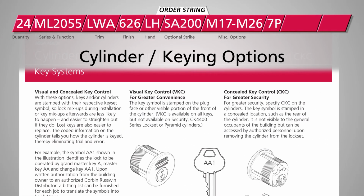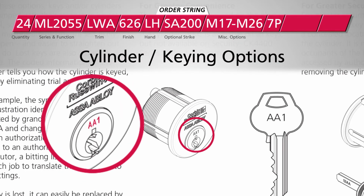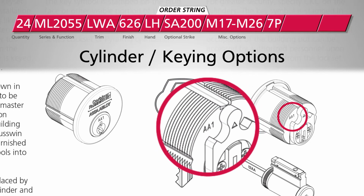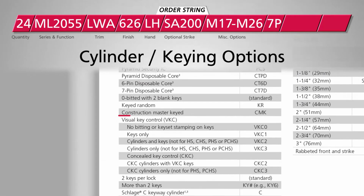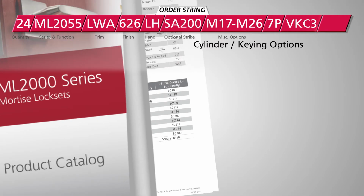When ordering Corbin Russwin lock sets, you can choose between visual or concealed key control. With visual key control, the key symbol is stamped on the plug face of the cylinder. With concealed key control, the key symbol is stamped in a concealed location, such as the rear of the cylinder, so it's not visible to general occupants. We'll select visual key control cylinders only, so we'll enter VKC3 for this order parameter.